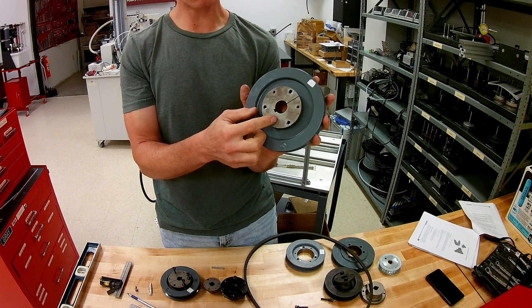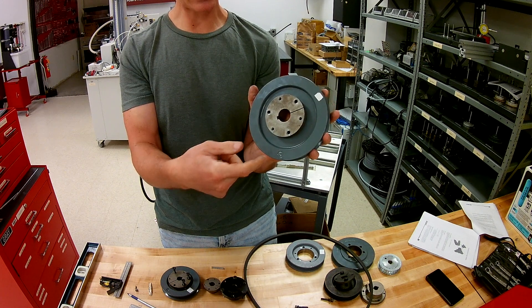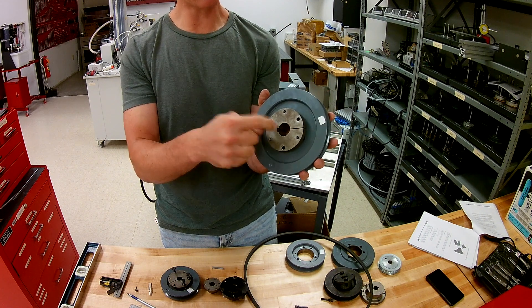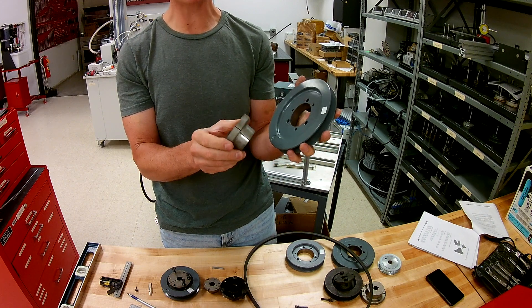This is a very good method for driving because not only do you get the drive from the key, which can push that around the shaft, but then all of these surfaces are much closer, so it's a really good bond as far as the shaft goes. It eliminates wobbling and everything else, but there's a certain way to assemble it and a certain way not to. We're going to talk about how to do this.